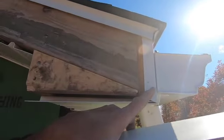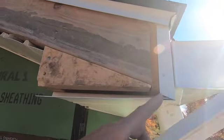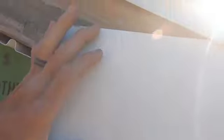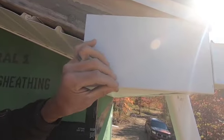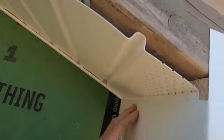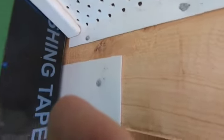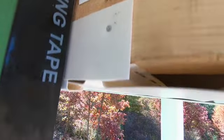That'll go together right there — that little notch lets these two pieces come together nicely. Here is where these returns coming around the end really help out. My piece is just a whisker shy, but that return gives me nice white coverage right around there. I'll put a little silicone along the bottom here and a couple of tacks up in here — it's a small piece, so it won't expand and contract too much. I'll start here and work my way around, keeping it nice and level. I've also added a small piece of soffit to keep everything as plumb as possible — that little return would hold it out otherwise, so this keeps it coming straight down.